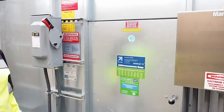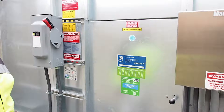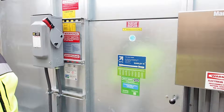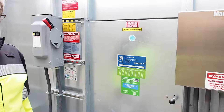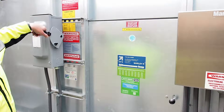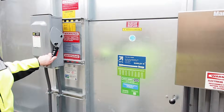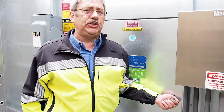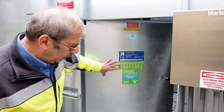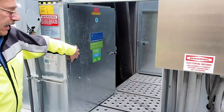This Marley NC series cooling tower has a motor, gearbox, and fan assembly inside. It's important to note that before you access this equipment, you should throw the disconnect to disable the fan and lock out if your safety procedures require it. To access the door in this manner is relatively easy.